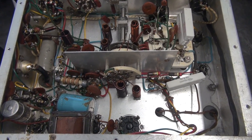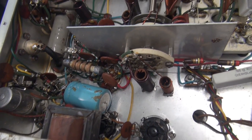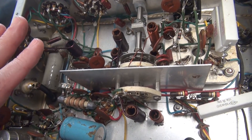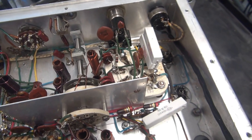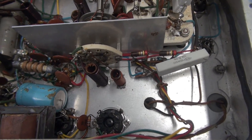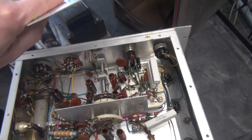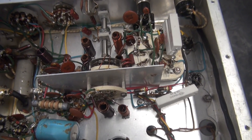Here's the bottom side of the main transmitter. It looks like these caps have been replaced. There is a gigantic — I think it's a 50-watt resistor — that steps down the 600-volt plate to around 300 volts to operate the rest of the circuitry. Everything in here actually looks pretty clean. I can see some resistors have been changed, but very little maintenance overall — I was actually pretty surprised when I opened it up. And I do have the bottom cover. Like I said, this thing was 100% complete when I got it.